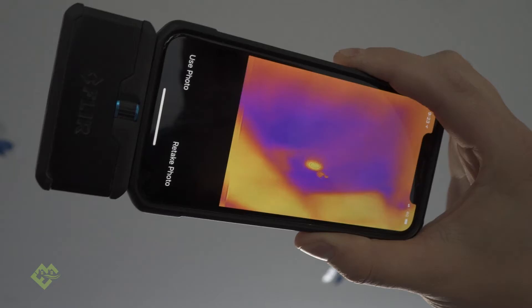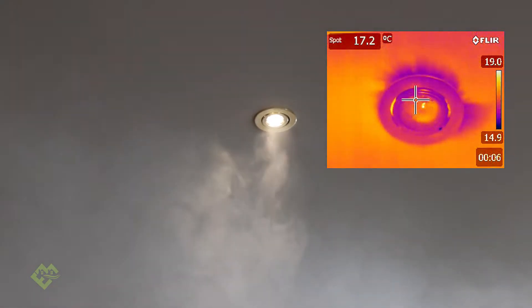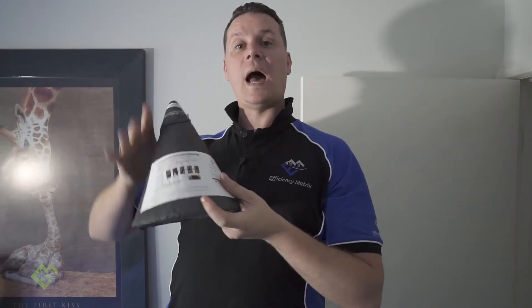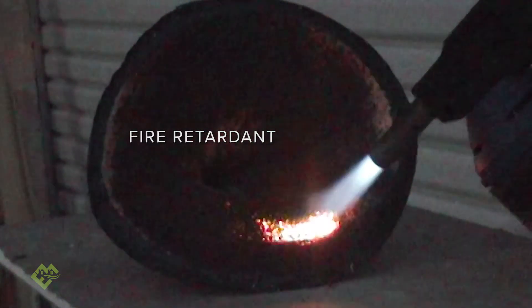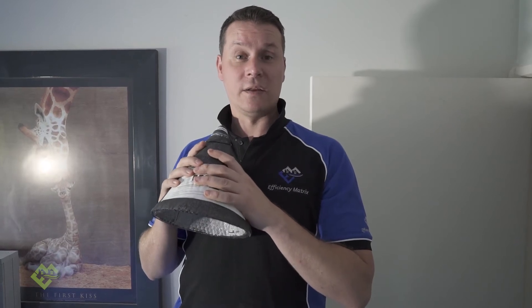The downlight cover adds considerable value when it comes to insulation consistency because they're made out of a rockwool material, so they're quite insulative. They also improve air tightness — they reduce airflow through the luminaire, especially if it's a gimbal type fitting or ventilated, as some LED luminaires can be — and they'll also give you a fire rating. They stop the heat from this room moving up into the roof cavity or through the plaster. In hotels, commercial applications, or aged care homes with fire-rated plaster envelopes, this downlight cover will insulate against fire moving from one room through the plaster into another area where there is a recessed lighting luminaire penetrating the fire-rated plaster.